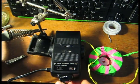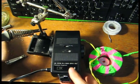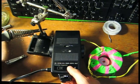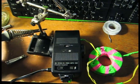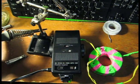We'll push the button, and the eddy currents will eject the washer, showing that a strong magnetic field is pulsing through the coil via the high voltage. 3, 2, 1. And there you go. See, that just flew right out of there. I'm not sure even where it landed. But there you go. We'll do it one more time.